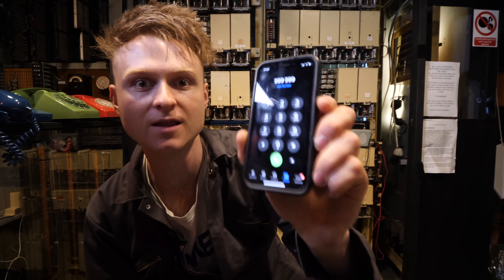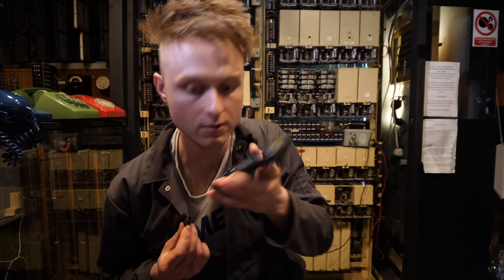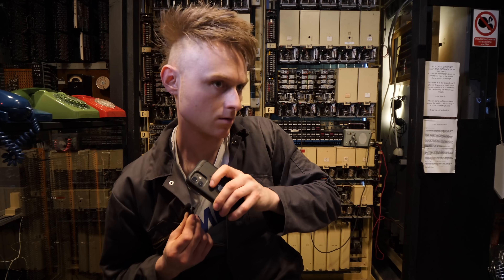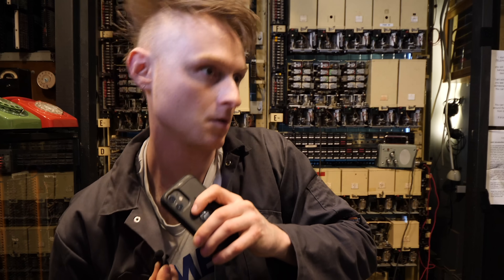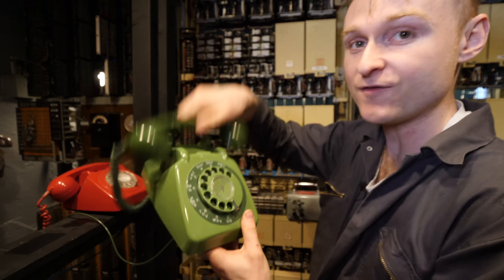But this magical chip still doesn't solve all of our problems. We have one big problem left: the kind of phone that people will usually be calling in on uses DTMF — dual tone multi-frequency — to send the numbers across the phone line. Those are the bleeps and bloops when you type a number in on your phone. The telephone exchange sadly doesn't talk in that language — it talks via pulses. The type of phone that talks to these exchanges has two wires going into it.